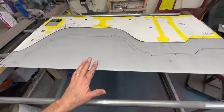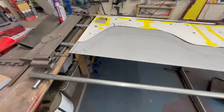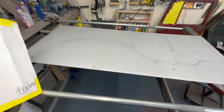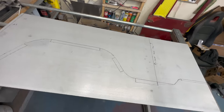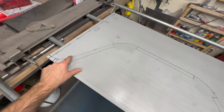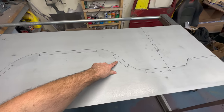I'm going to cut this out along here, along here, here, and here. Basically this is the one-inch thickness that the folded-over flange is going to be — I'm going to make one-inch pieces and fold them to that shape and weld them. I think it'll keep the quarters straighter. When you pull the pattern off, that's what you've got, so it'll get cut. I typically score it ever so slightly wherever there's a fold, and then we'll hammer and dolly it.